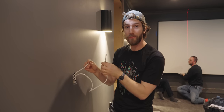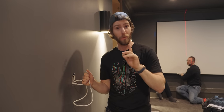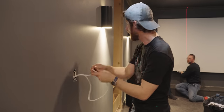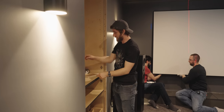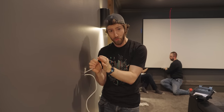This is cool — we've actually got each of our speaker locations wired up twice. This ended up being a miscommunication with the low voltage people, but it worked out really well. They're wired up once with four conductors, so I guess we could bi-amp them or run them in duet mode if we really wanted to. That goes to this closet right here, so you can have your receiver there with connections to all your subwoofers and speakers. You've got ethernet and power and all that good stuff. And it's actually wired up again with just two conductors to the mechanical room, so if we wanted to rack-mount everything in a completely separate room for perfect silence, that could also be done.